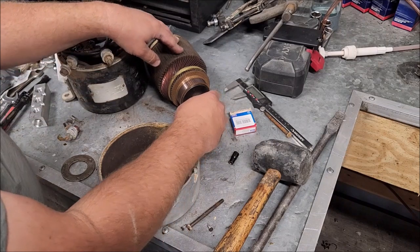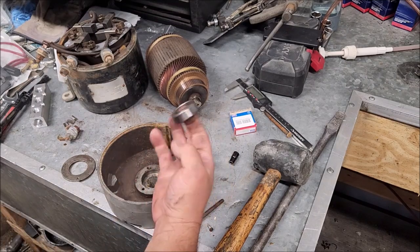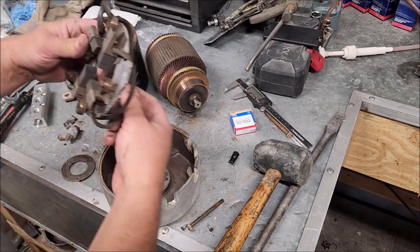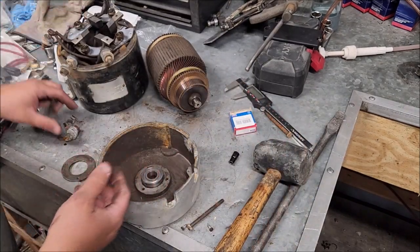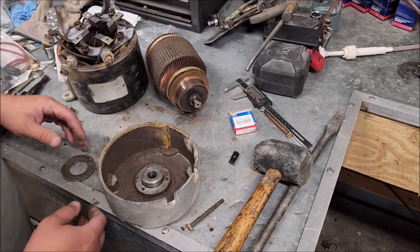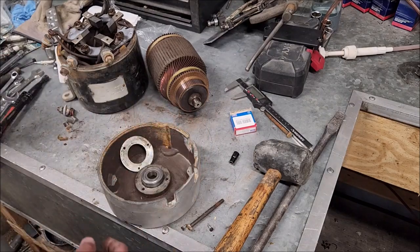The bearing is not really pressed in but it's kind of hard to get in there. So it sits there. What I assumed happened on that motor was the bearing was shot. This motor has a problem with its brushes - a bolt broke off, so it needed new brushes while it was there. Here's the old bolt. So while I was there I sized the bearing and ordered a new one.